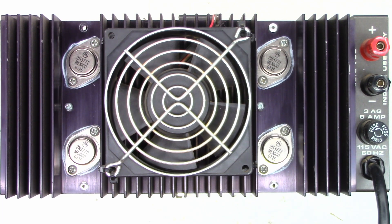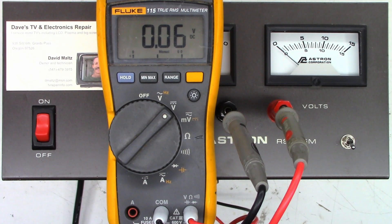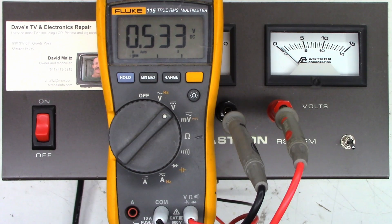Let's go ahead and fire it up with that base drive lead still disconnected. Here we go — base drive still disconnected, 120 volts going in. And once again it is slowly rising, but it is slowing down, and it's almost stopped at 0.52 volts. It made it — 0.53. Putting it back in auto range: it's holding at 0.533, 0.534 volts. That's half a volt — not that bad. I guess time will tell if this actually repaired the problem. I'll let this discharge the main filter caps and the LM723 filter caps, then attach lead number four and see if this thing fires up correctly.